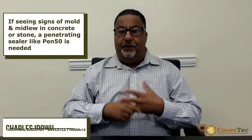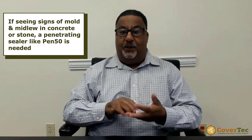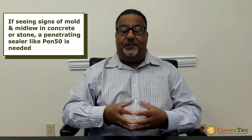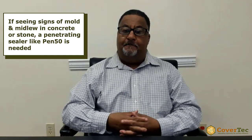So if you're seeing signs of mold and mildew in your concrete or on your natural stone, your limestone, or maybe on the slate, any kind of porous surface that's showing signs of mold and mildew, that's a good indication that you need a penetrating sealer, something like the Pen 50.